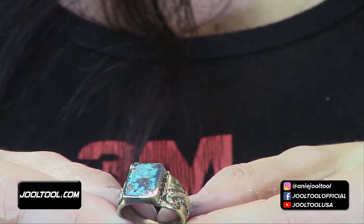Basically, yesterday I learned what that 1 minute, 5 minute, all that stuff means. Basically, you have 1 minute to put that on and get it going. Because by the time I finished talking and Yara mixed the epoxy, it was dry. You guys saw that. So that's why, like Heidi said, by the time I put the copper on the epoxy side, that window was closing. Your opportunity was now closed. So if you need some time to load it, honestly, I would stick to the 5 minute epoxy because I was being rushed on every angle, you guys.